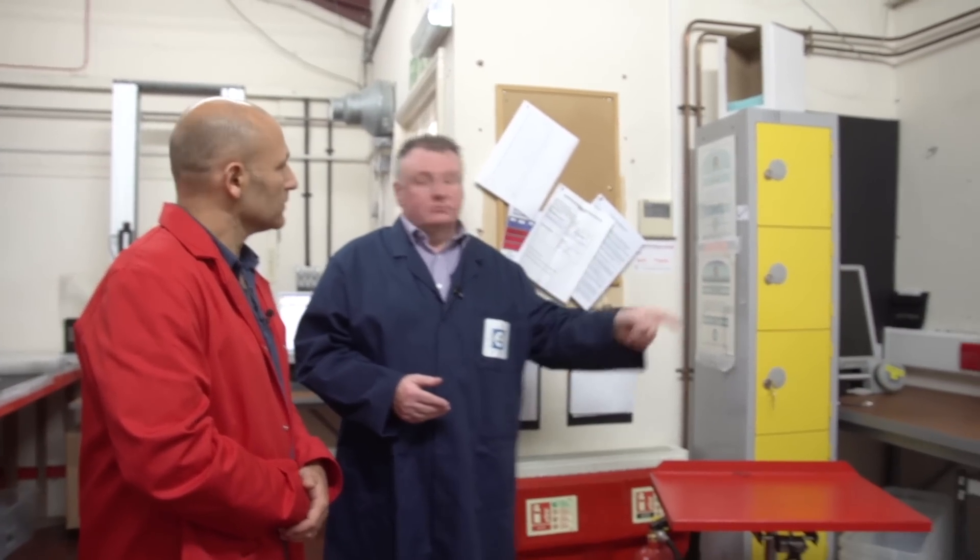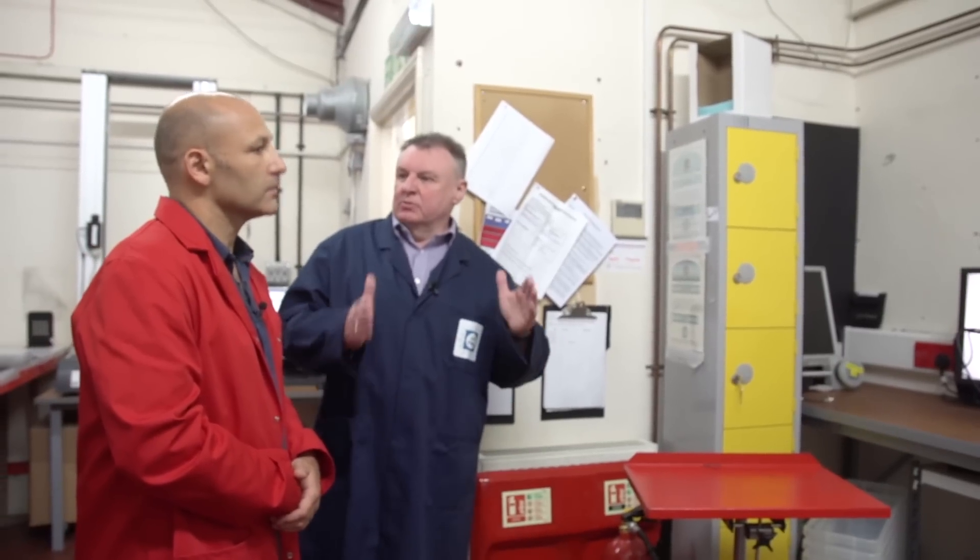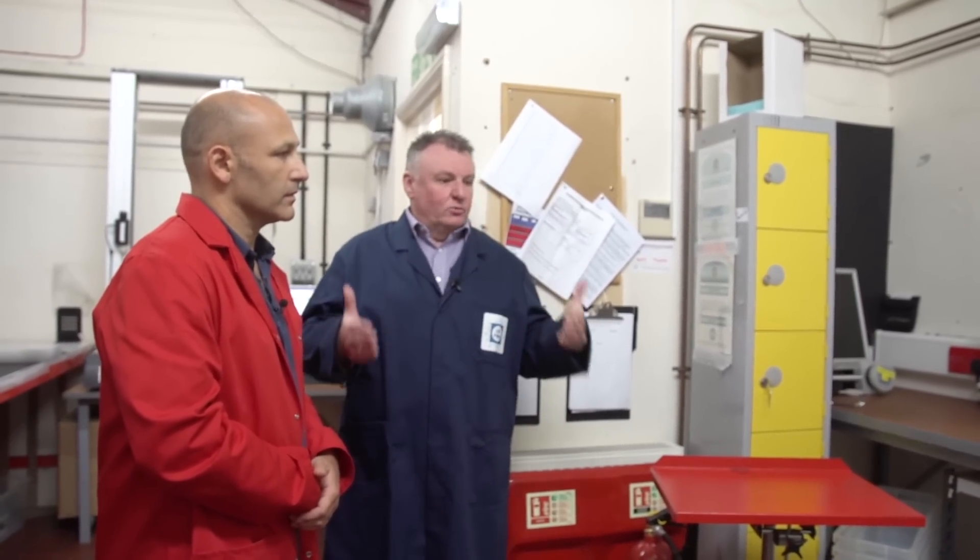So based on the hardness of the sheet and the pressure that the machine measures, that will determine what it can be used for. The next section — we've checked the pressure and we're happy with it, but we also want to make sure that optically the product is acceptable before we even start dyeing. This is the first process and it's the most important. If it fails, it doesn't leave this room — it would be scrapped. Quality control is very high.